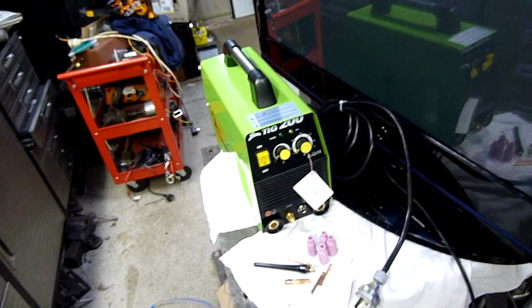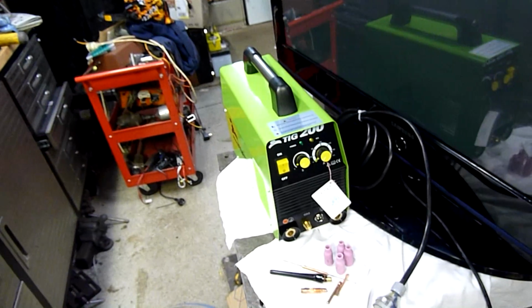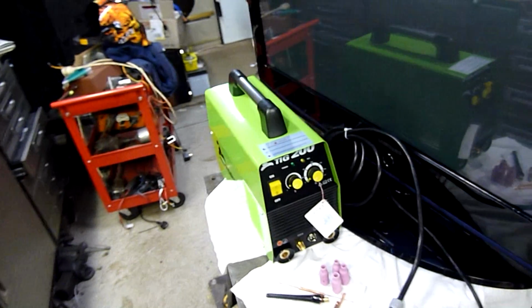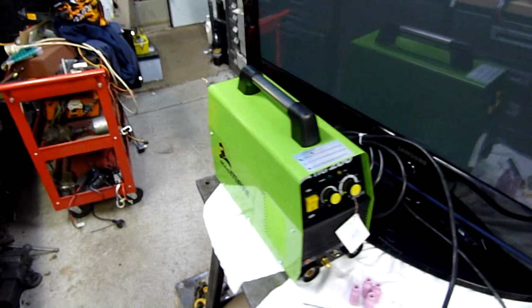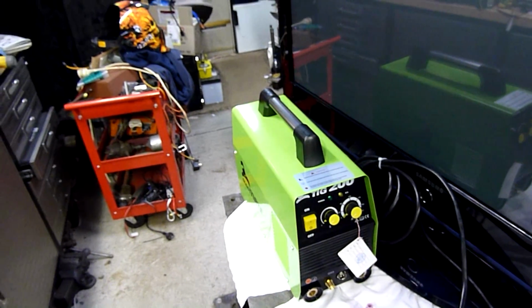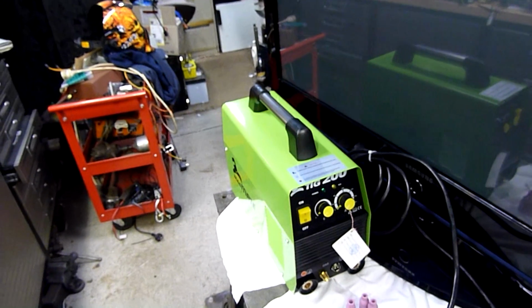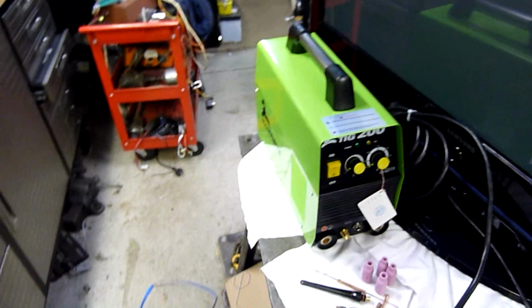I'll start out with straight argon because that's what I'm used to using, particularly on stainless. But I might even swap over to a blend or a tri-mix maybe. I was talking to Obliterus on the Geek Group IRC for a bit the other night, and came up with some good gas alternatives and things, so it's worth a look in.